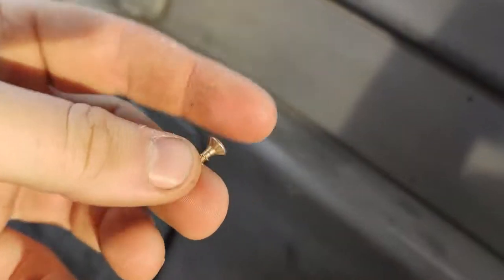I've got those holes marked down. Next, find out how big your screws are — these are minuscule, I think about 6mm — and get the appropriately sized drill bit. Drill a small hole in each one; I go about a millimetre smaller than the screw size. They're just pilot holes, they don't need to be full size so they grip a bit better and cut their own threads.